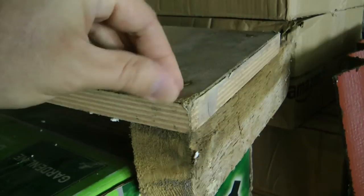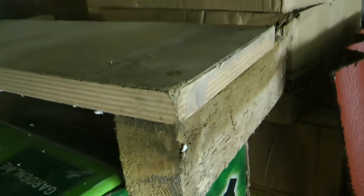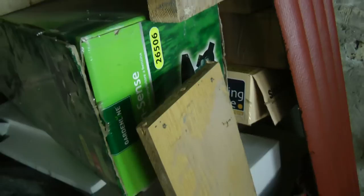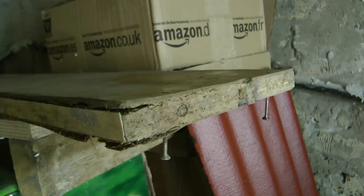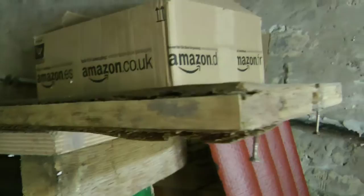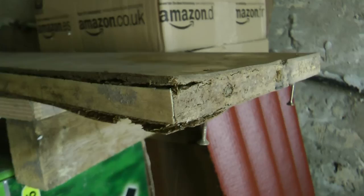I'm showing you the pieces of the mold I saved from last year, in case any arch failed over winter and needed recasting. You can see what a wet concrete mix does to particle board — it expanded from the moisture, started to bend, and is now crumbling and cracked. This is expected behavior for particle board. If you need to cast many identical pieces, you'd be better off using real hardwood. For a small batch like this it was fine, but these mold pieces will likely end up in the trash or on a bonfire.